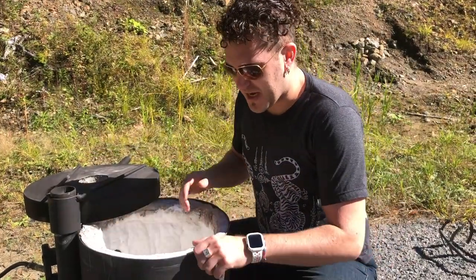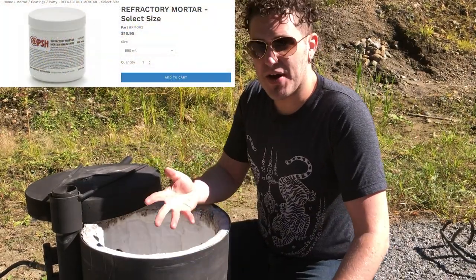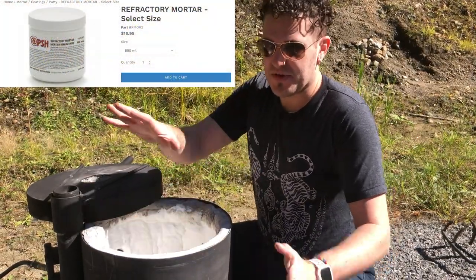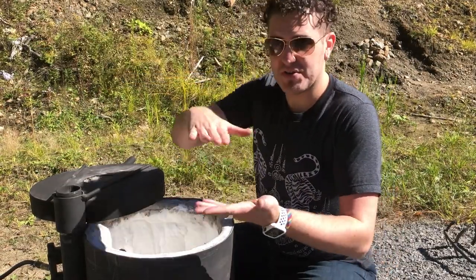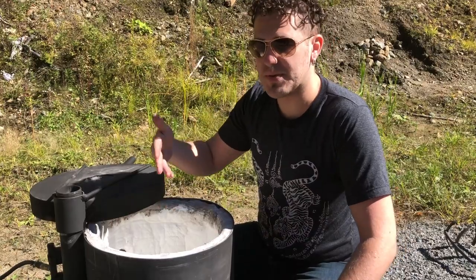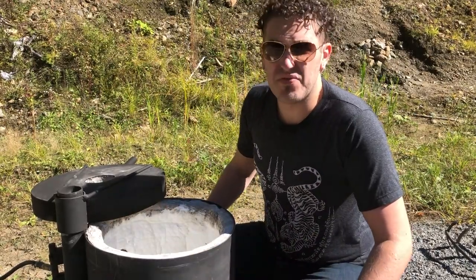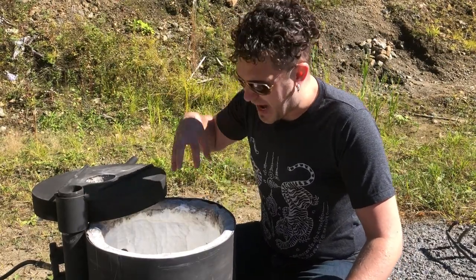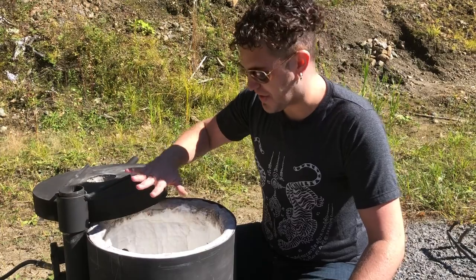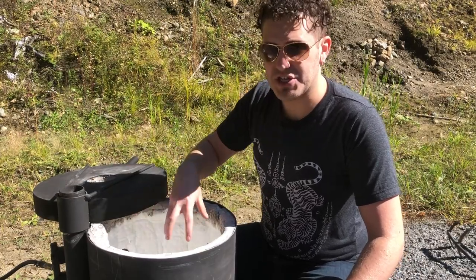Around the top, I'm also using a high temp mortar, typically used for kiln repair — if a little thing falls over and gashes one of the bricks, you can use this to make it nice again, or to stick bricks together inside a potter's kiln. This stuff has a maximum temperature of about 2000 degrees Fahrenheit. I've also packed the bottom with an extra thick layer of Kaowool and then put the kiln shelf on top of it.